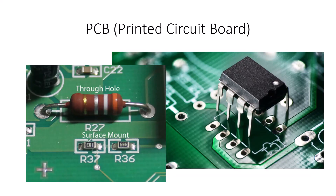Printed circuit boards are really fabulous for a permanent circuit. Notice on the left it shows two different kinds of components that can be mounted on printed circuit boards. One is called a through-hole component because the leads poke through the holes and are soldered to the opposite side of the board — that's an older style, still used extensively. Newer electronics, often done by robotics, is surface mount technology — very small components mounted on one side of a board with no leads that stick through.